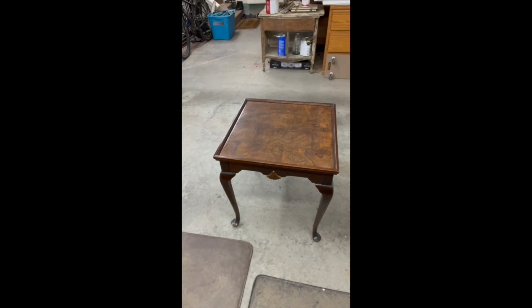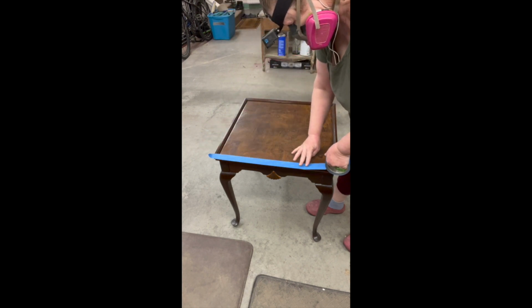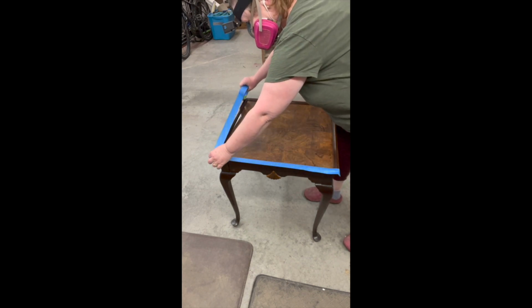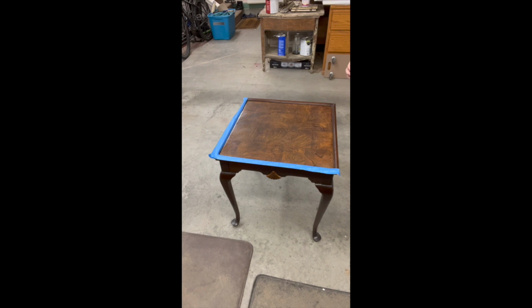All right, so here's what it looks like. I think this is after the 320, after the night, and then here I did it right there. Yeah, so once again, you spray the lacquer on. You can do multiple coats, but if you let it wait for more than 6 hours, you have to sand in between. So unlike polyurethane, where they want you to sand between each coat, it's not the same with lacquer. It doesn't need it. It will bond by itself. Then, afterwards, when you're all done, that's when you do the wet sanding.